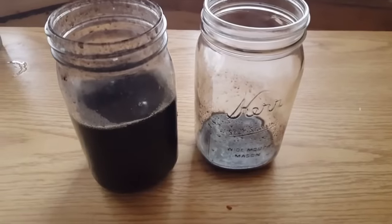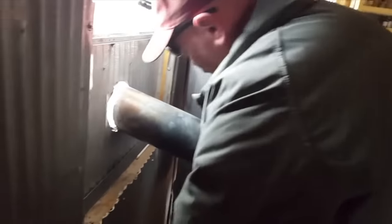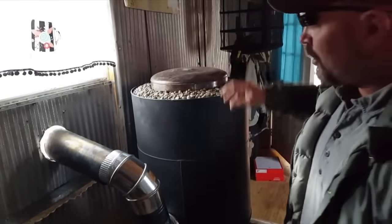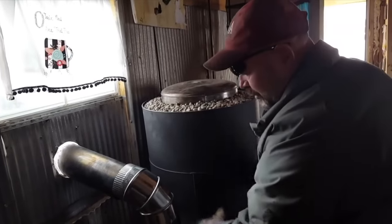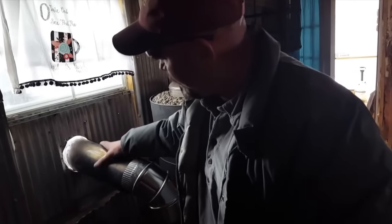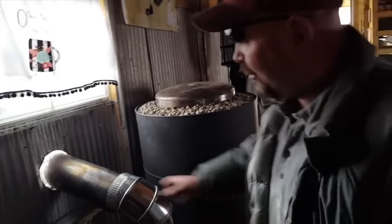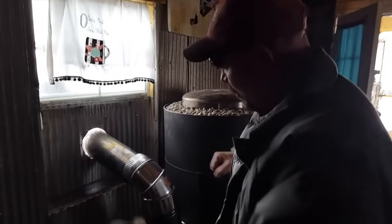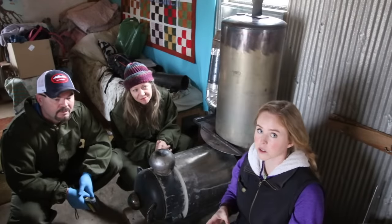We've been collecting a special concoction underneath that pipe. Darwin thinks that because it's a single wall tin pipe, it's cooling too much as it comes out. The air forced up the insulated riser creates positive pressure in here — hot air doesn't want to go down, but the positive pressure forces it down. By the time it gets over here, there's no insulation and the mass absorbs all the heat energy. The cold air outside and the warm air inside create conflicting pressures.